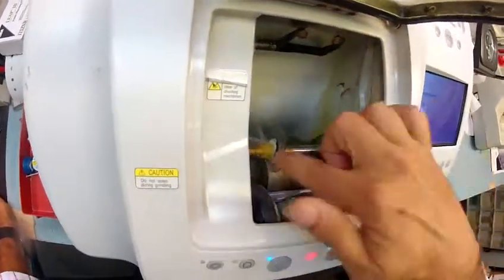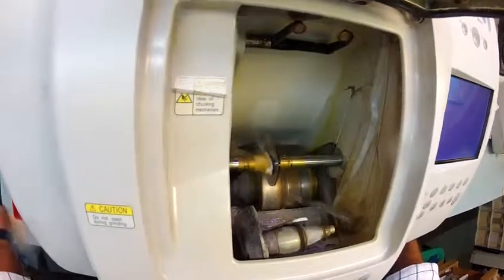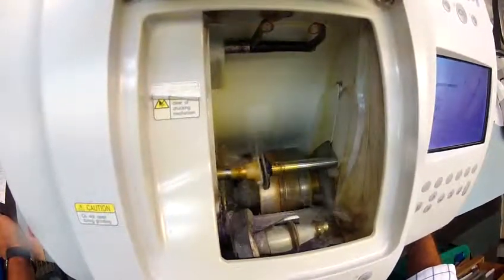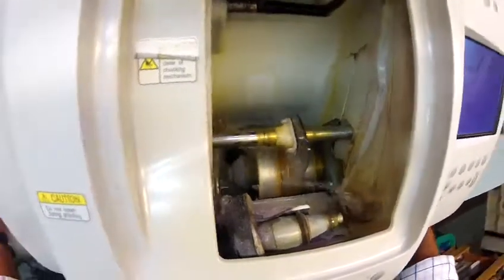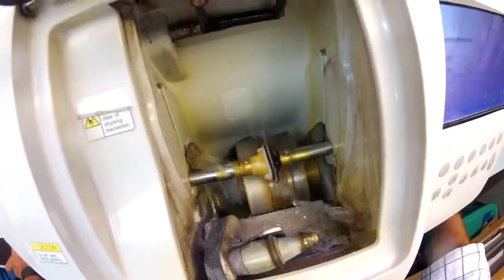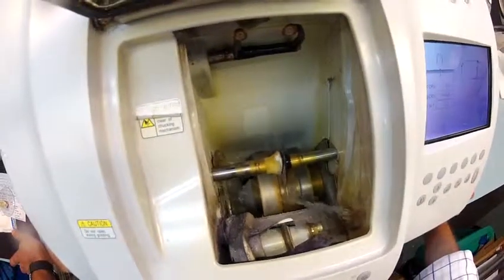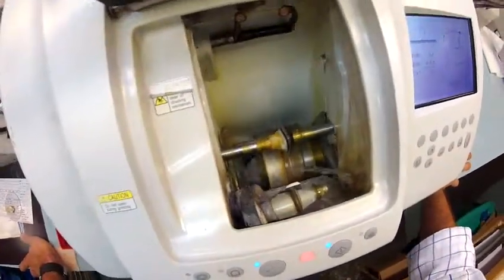This is the outside of the lens, and coming around now is the nasal area. If you notice, your lens is still completely flat all the way around just like a nickel — if I were to take it out now it would stand up on the counter. But now it's getting the bevel put on, which is the knife-like edge, if you will — a very dull knife. Just sharp enough that it may cut a piece of tissue, but you would have to soak the tissue in a bucket of water overnight and then press very hard with your lens, and it just might cut through the wet tissue.